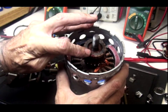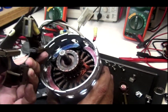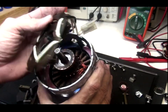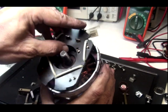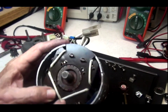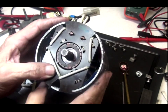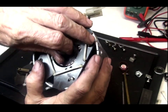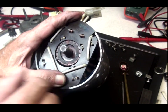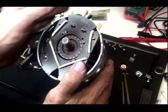This is going to be my positive. The way I have been firing it — this is the brush board, I removed the spring so we can see it. This type of motor, the Bosch 20-pole, the brushes fall exactly in a position. The brush is starting to almost touch on that commutator, and this is a counter-clockwise motor. That's the way it rolls the wheel on the scooter.